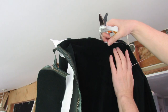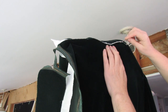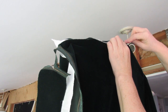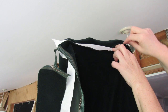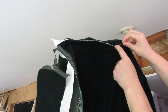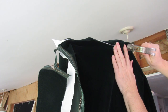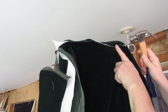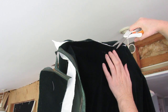So here we are — here's my first cut. It looks a little bit generous but there's the piping with my needle. Pop the fabrics, both of them, round the metal. Use the back of your pin — roll the top of the pin like that — and really stuff this fabric under the piping. With your hammer and a bit of fabric — not too much — you just tap it in just a little bit. You wrap some fabric up so you don't bruise the fabric you're locking in. And then you go to the next part. And if you have to cut down, you can, because if you shape this it will go in better.